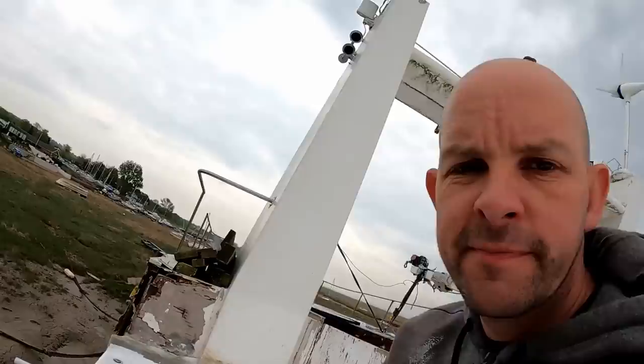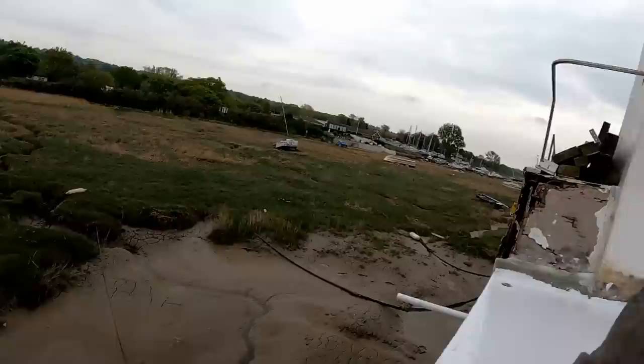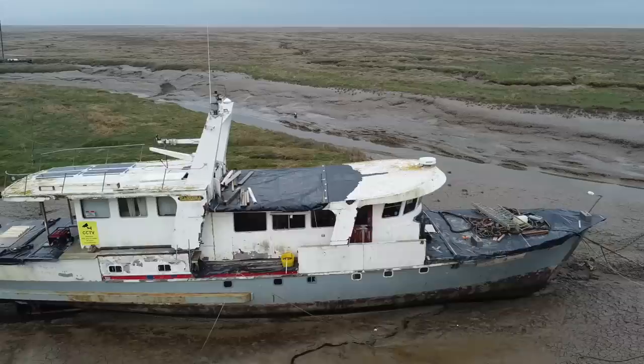So I think from that test it's proved that because the fly bridge isn't in, it's just going off the edge, which I kind of knew it would. But what I think we'll do is put a line of sealant all the way down as a dam, so it encourages it to go into the drains rather than over the edge, because it's still coming off the edge, isn't it? So I think that's what I'll do now. Big line of sealant.